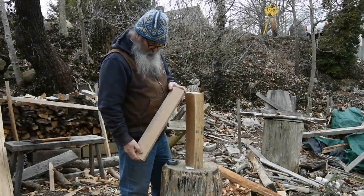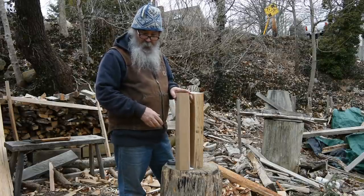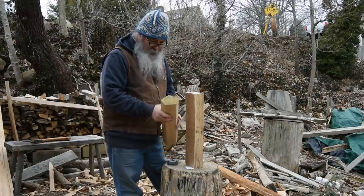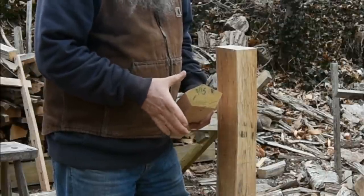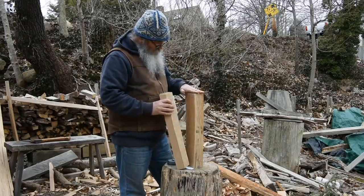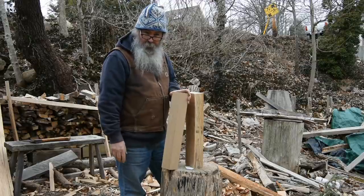The upper section of the cupboard that I'm building has a recessed portion that is really half a hexagon. The two front stiles have a cross-section like this — it's sort of like home plate in a baseball field that's been squashed. They begin as a block of oak like this, and I'll show you the steps I go through to first hew that shape and then take it in the shop and plane it.